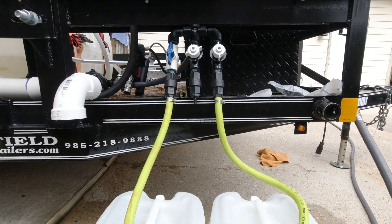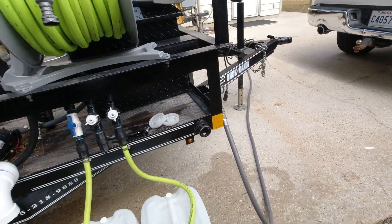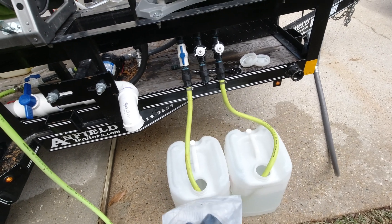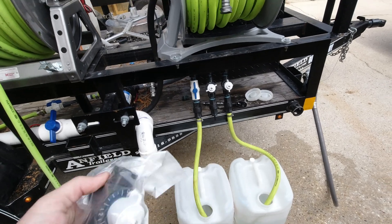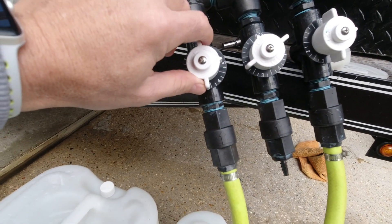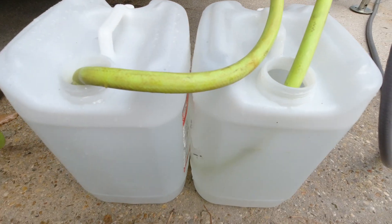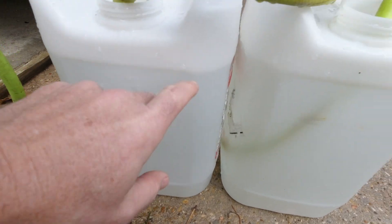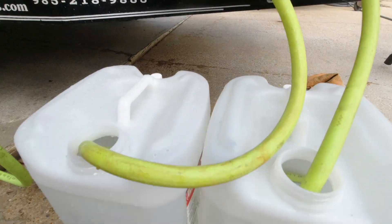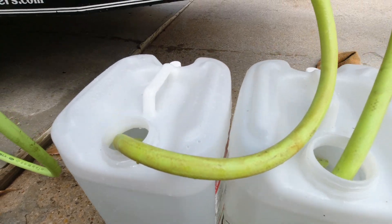With those results, since I bought three Pentair valves, I'm going to go ahead and replace the ball valve with the metering valve and do the same test to see if we get equal results — we should, but let's confirm. I swapped out the ball valve for the Pentair valve. I've got both valves set all the way to 5, soap off, and I have equal amounts of water in both buckets again with the same half-inch hose setup. The only difference is the ball valve has been replaced with a Pentair to see if the draw will be more equal.